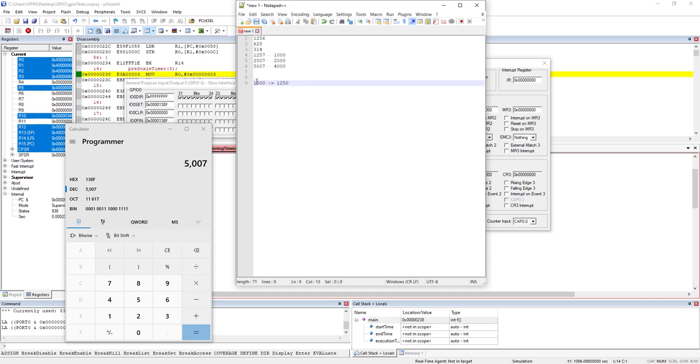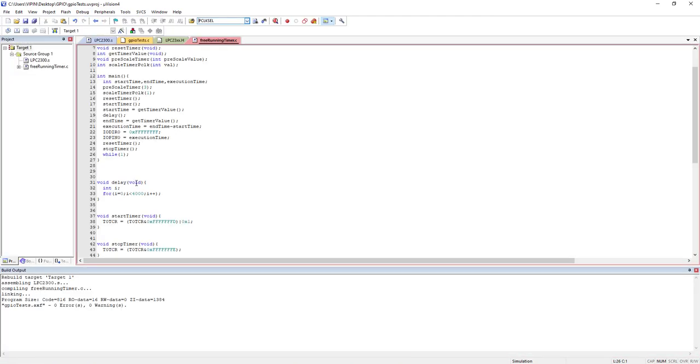So if the loop variable is 1000, and you use the same clock settings, using the internal RC oscillator at 4 megahertz, for a loop variable of 1000 you'll get 1250 clock cycles. You multiply this with the period at which our timer is running. Based on the settings we did, you'll be able to find out the actual time. Using that information, you may modify this function so that instead of a constant, you pass the required delay, and from that you calculate the maximum value for the loop variable, and create a function which gives you the required amount of delay. That's an advantage. Only this much when the timer is used as a free running timer. In the next video we'll see how to use it as a free running counter.